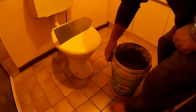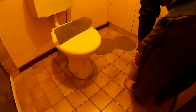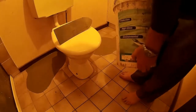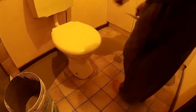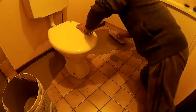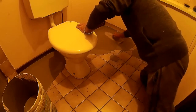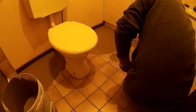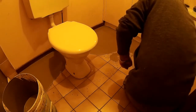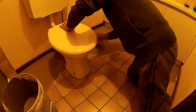As you can see, we're in the area I'm working at tonight — this is the ensuite of the property. You can see the ceramic tiles there. There are a couple of damaged ones, which really depends on whether you worry about lifting them out or not. But since this is going to be a firm base over the top of the existing ones, I'm not really going to move them — I'll just leave them where they are and simply pour the stuff in and trowel it out. Don't panic too much, you'll make a bit of mess. The toilet is also loose — I will be lifting it up later, but just so I can trowel around it. You can use knee pads if you like. You can use a trowel as well — the trowel is one of the main things. You just run it around the edges, as you can see it spreads really nicely. You don't have to wrestle with it, and that's the beauty of self-leveling — it's a nice fine mixture.